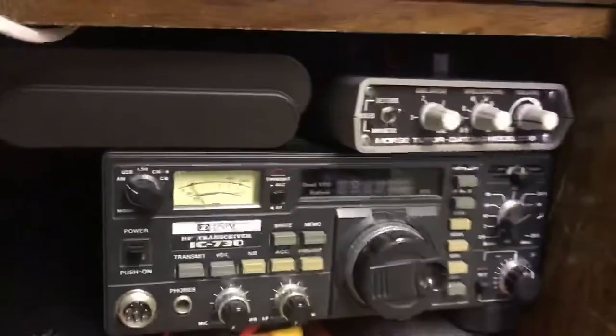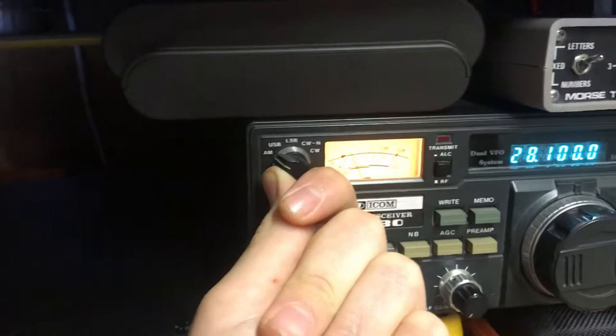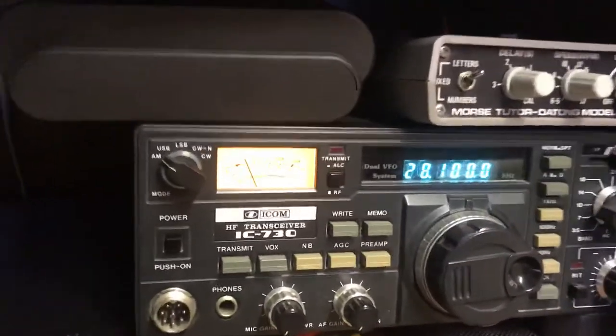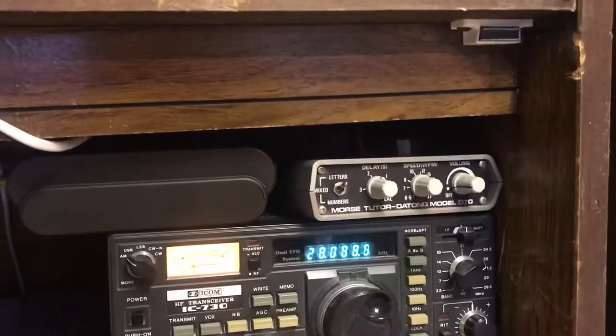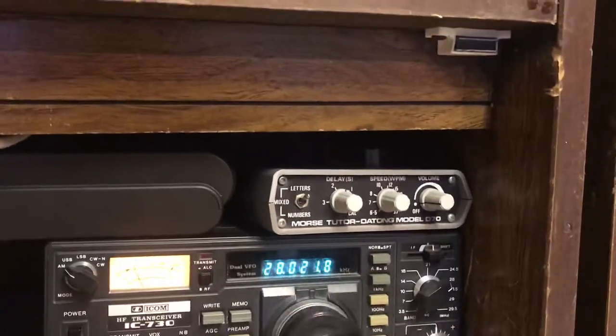This really is a pretty brilliant transceiver. It's got all the main modes except FM — AM, Upper Sideband, Lower Sideband, CW Narrow, and CW. It's got a frequency range of 3.5 MHz up to 30, so this covers basically the entire shortwave system. Short disclosure: it does not include the CB band — I have tried. It includes a bit of the CB AM band, but that is about it.